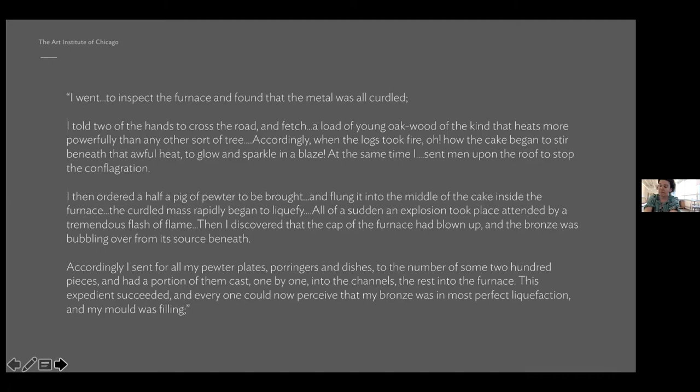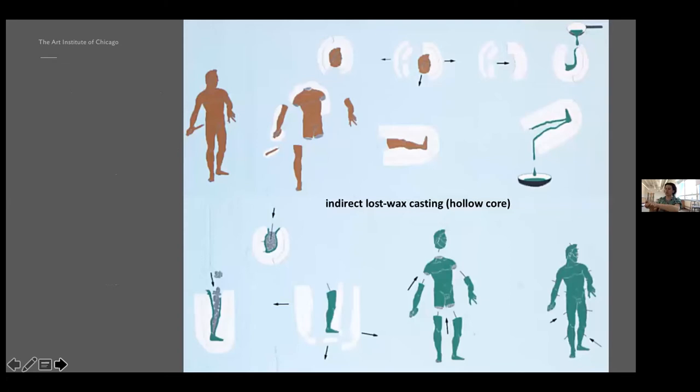Cellini's drama lays out quite clearly the perils and potential mishaps in casting huge objects. Melting large batches of metal is not easy; the alloy may not melt evenly, and vast amounts of gases are generated, which can be noxious for workers or trapped within the cast, resulting in porous areas or flaws needing repair. The larger a cast is, the more difficult it becomes to cool it evenly, and handling vast amounts of molten metal is challenging and expensive.